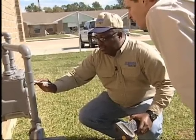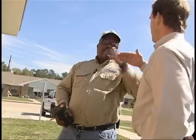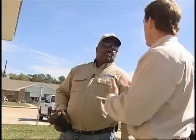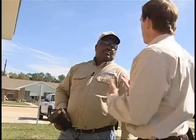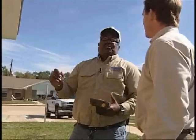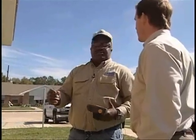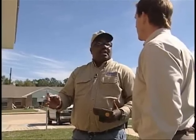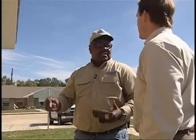It's important to observe that hand. If the numbers were extremely high — an exorbitant number that you're not used to — that tells you there's a problem, something's wrong. We'll make sure that the meter had been exchanged, then go in and check to make sure there's not a leak. If no one is home and the reading is really high, we'll turn the meter off for safety, leave a blue tag, and once they come home, we'll come back to investigate and make sure there's no leak. We've read this one — let's go on to the next one.